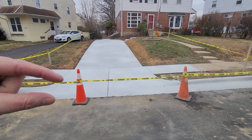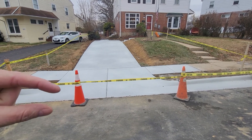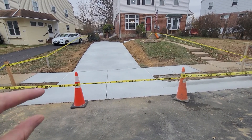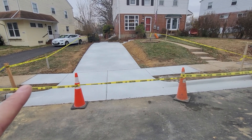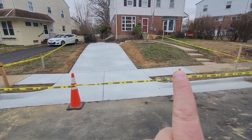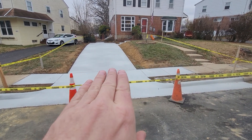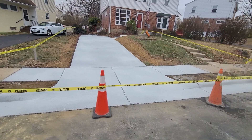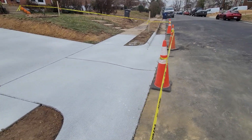The issue is if you followed the normal grade of the land, this would be more than a 12% slope here, and most cars would bottom out. So what we're able to do is we start on the left side here and we actually angled this sidewalk down about two inches or so, and then the same thing on this side. That actually depressed this whole apron into the earth about two or three inches, and when you look at it, there's barely any steep angle at all.